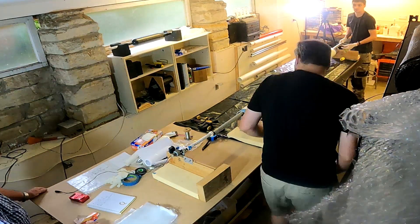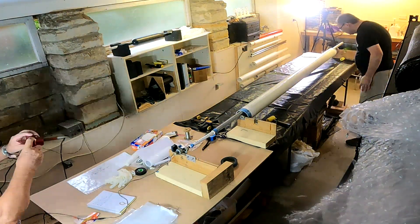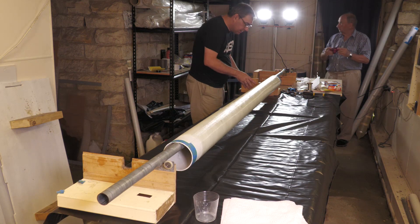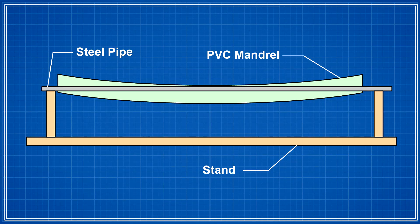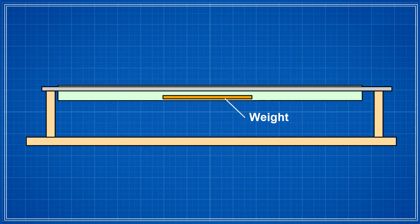When all the cloth is rolled out we put it on the rotisserie. The PVC mandrel itself has a very slight bend to it — the bend is exaggerated in the diagram to make it clearer. After the epoxy has had a chance to gel we stop the rotisserie so that the bend faces up, sitting on the steel pipe. We then insert a long weight into the middle of the PVC pipe which straightens out that bend. We let the tube cure like this overnight and you end up with a straight tube.